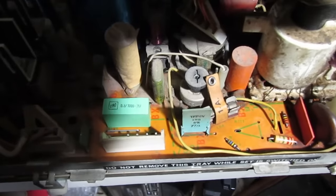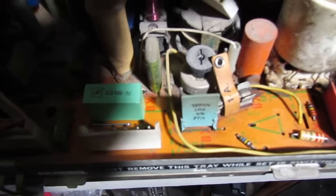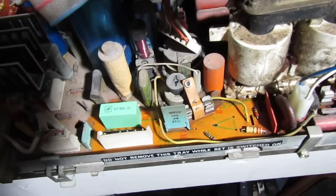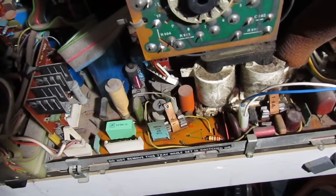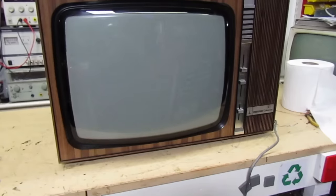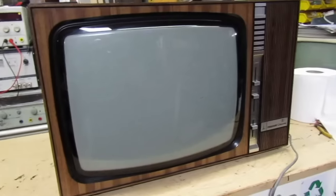Let's get a bit of light on there - I've cleaned all around the A1 pot and the capacitor. You can see the circuit board is made by BXL. Really this whole lot should be taken out and cleaned properly, but at the moment I'm just concentrating on getting the set working. I think now when we put that pot in we should be seeing something on the screen. Here we go again - three, two, one - and it's on.